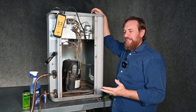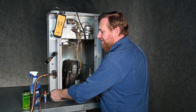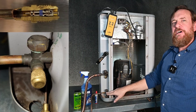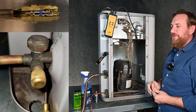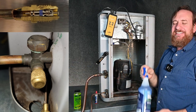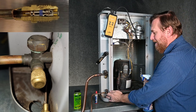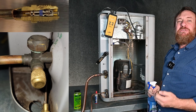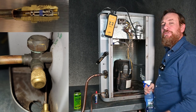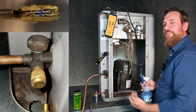What I like to do is start with the simplest thing. One of the most common places for refrigerant leaks is going to be at these valve cores. When we hook our gauges up, that valve right there is notorious for leaking. Make sure you're doing it the right way when testing it. Bubbles are a great way to test, but we do not want to put bubbles right up inside of that connector because it's going to contaminate the system as we put refrigerant in, or contaminate your hoses and equipment as you're taking refrigerant out.